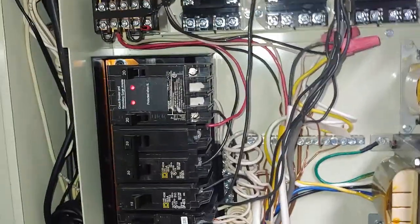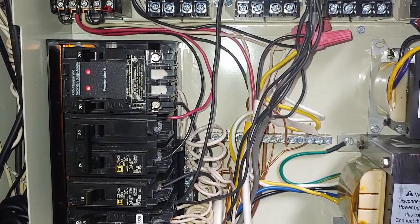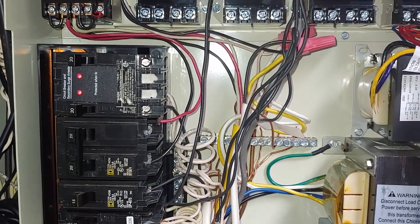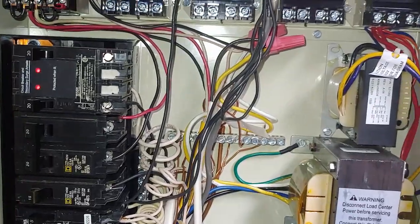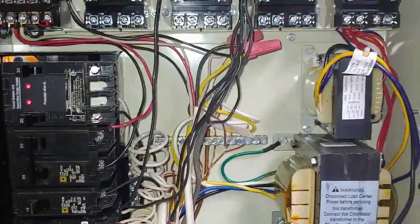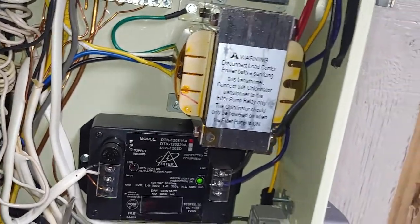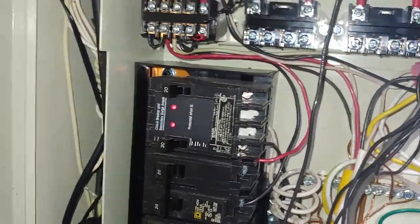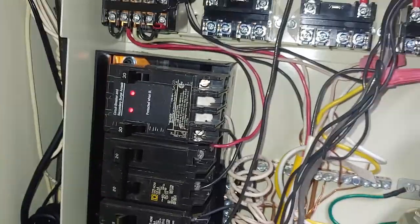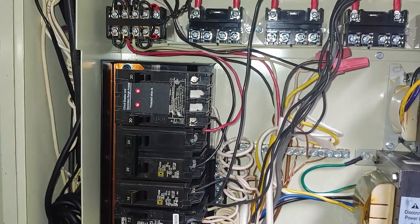I was having issues with surges coming in from somewhere in my system. I traced it to my Screen Logic system — there's a four-wire coming in for the automation that I had hardwired to the house, and I believe there were brief surges coming in on that. I put in additional surge protection on one of the legs. It was also coming through my low voltage, and I even had protection on that. Again, you can have multiple surge protection devices — the more the better, because it captures more of the load coming in that may be causing your issues.